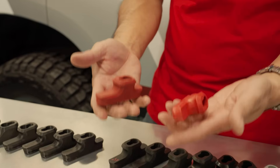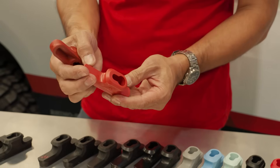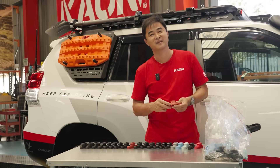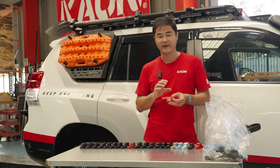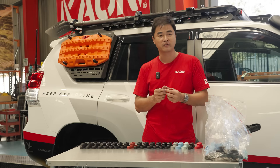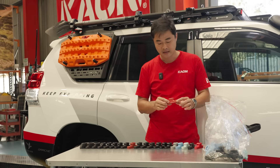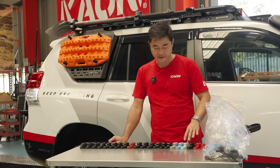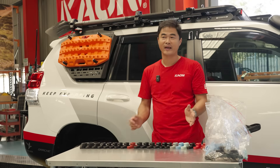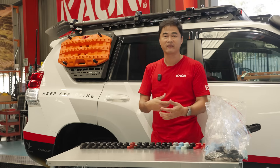That red patchy carbon fiber filament prototype is actually not too far different from the final product, but there's a weight difference — the 3D printed ones feel really light, potentially weak, while these injection molded ones have a bit of weight to them. Because it's a slightly softer material with a bit of give, it actually feels really good in the hand. The biggest challenge when developing this was allowing for the fact that plastic — whether it be the Maxtrax or the tool itself — changes in size and has different properties. Trying to get a good balance that gives form and function while allowing it to clip and hold in place was a big learning for us. The fear factor around injection molding was the time and cost of tooling — once you commit to that tooling, it's really hard to change it, and you have to invest again.